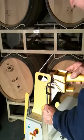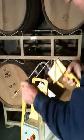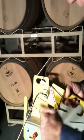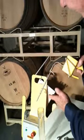If it flashes red very rapidly, it means we have a leak still, and it's recommended then to go back and tighten this nut again. That's really the only source. Now it can have an internal leak, but if it has an internal leak and you can't clear it from the outside, then you'll have to ship the handheld controller back to the factory for repairs.